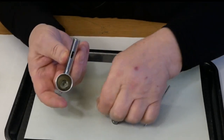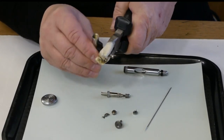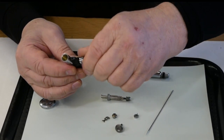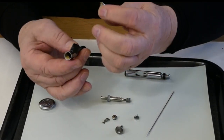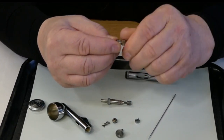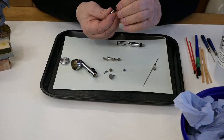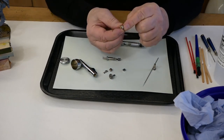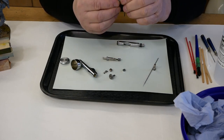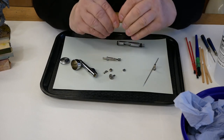That is looking okay. And as the customer has said that it is the air valve, he thinks maybe an issue with the airbrush. The pin isn't sitting forward. The pin on the air valve is sitting way back, so I'm assuming that by all the marks around the head here, the customer's had the air valve out to take a look at it.